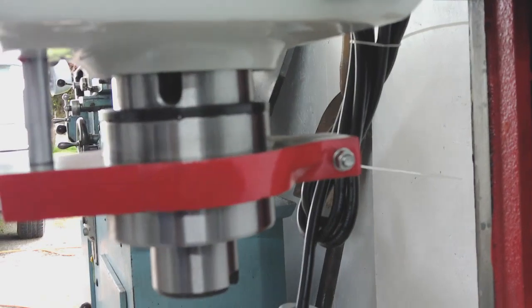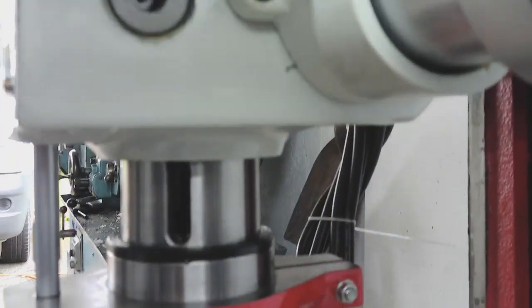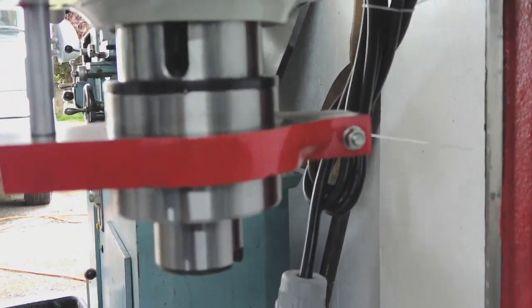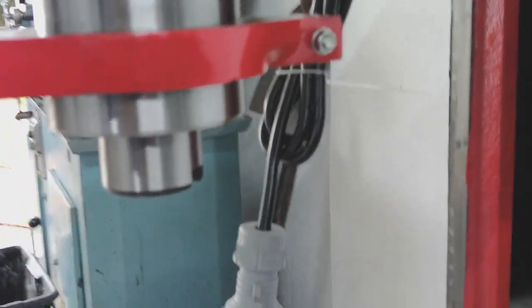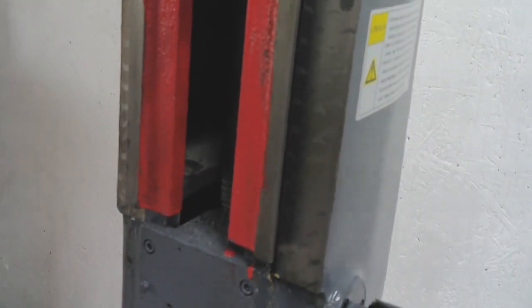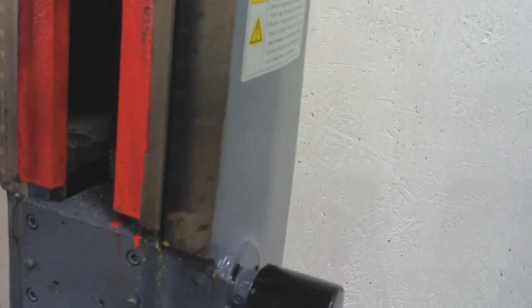Basically, I've cleaned all that spindle area up now, so that's much better. It's had a nice light oil over it. So that's good, that's got rid of all that horrible red, nasty grease stuff that there was all over it. I've just taken the bellows guarding off the column with the intention of cleaning the column slideways and getting all the rubbish off and giving them a light oil,